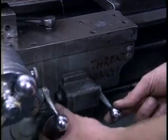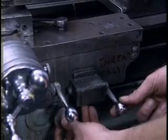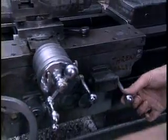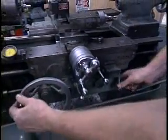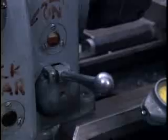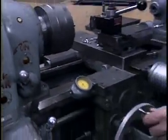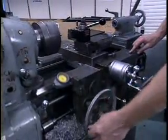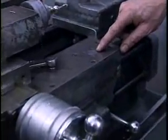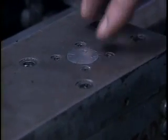You use this lever by setting the forward reverse knob on this particular machine in neutral. Now you find, you push this lever down in certain positions, it will engage the table with the thread feeds. Now let's turn the machine on. Now if you look at what the thread feed indicator is doing now, it's coupled to the screw. So it's indicating that the screw feed is turning.